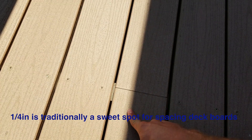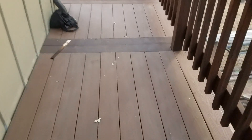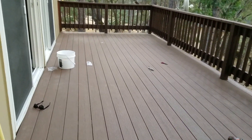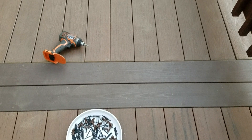That's also why we recommend the other solution — doing the framing and having your composite wood separated by a couple pieces of deck board. This does two main things: it allows you to have consistent boards. We have 20-foot boards on one side and eight-foot boards on the other side. This reduces cutting, reduces miscuts, and assembling time is a lot quicker. It also looks a lot cleaner because you don't have all these different sectioned-off areas.